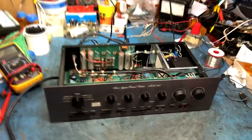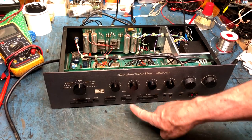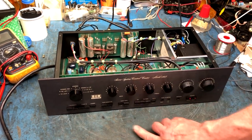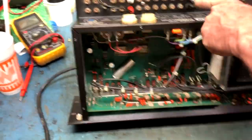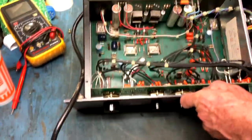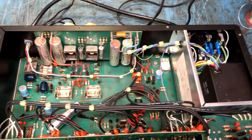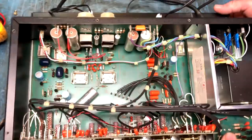Hi, it's me again — just popped in to see what was going on. I have a BGW 203 preamp, made in America back in the 70s, just figuring this thing out. Customer says when you don't have the EQ equalization in bypass, there's no signal — and they are right. Bypass: I've got signal. Tone circuits active: nothing. I suspect it has to do with EQ in and out jacks on the back where a jumper may be required. The schematic is not on the internet, so I'm doing this blind. It's built in America, weighs a ton, all American parts, lots of tantalum capacitors — that's never a good sign — plus and minus 18-volt power supply is good, switch is a little dirty.